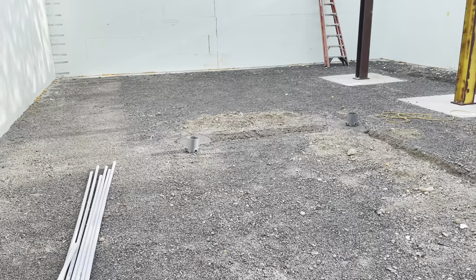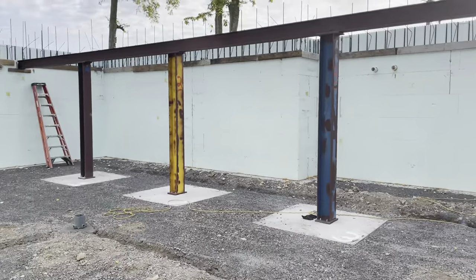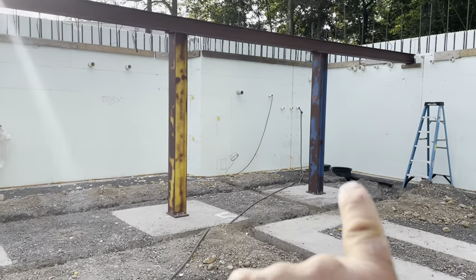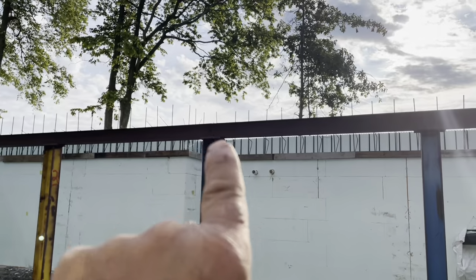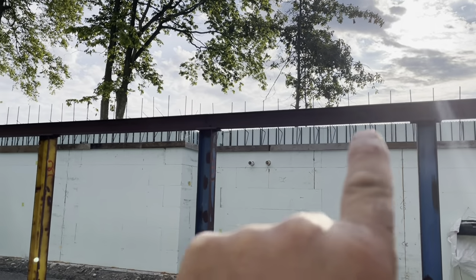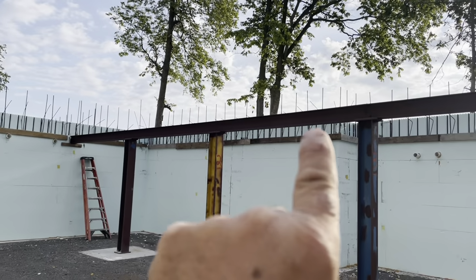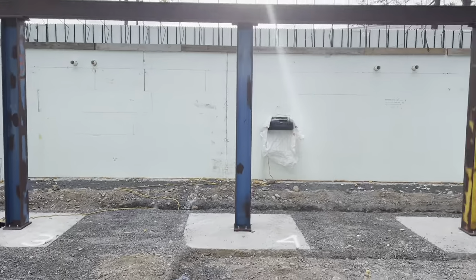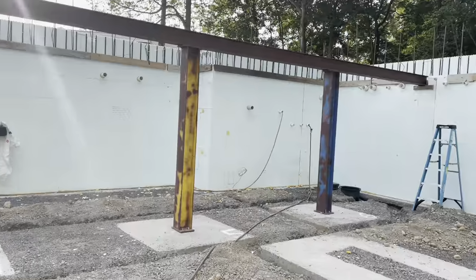Okay, it's Thursday morning. We're down in the basement. We got our six posts in permanent, four bolts in the bottom of each one, and then I just welded the top. And then right there's our seam. This beam's 40 foot, 2.5, I think, and this beam's 30 foot, 11.25. Welded that together. Got along pretty good with our brought in welding lead extension cord, and that worked good.